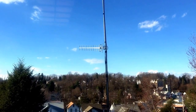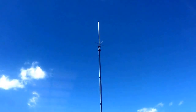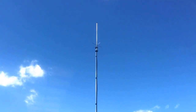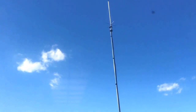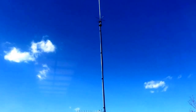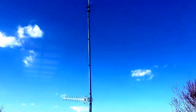So I'm gonna keep this antenna here in the middle for the living room — I'm just gonna extend the coax because it's RG6. The antenna up here is brand new; it's running LMR 400, which is the thick stuff. You might be able to see it on the pole — it's the thick black cable.